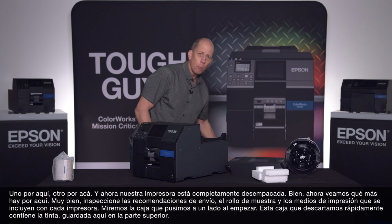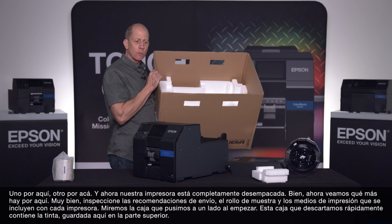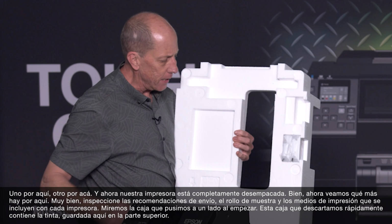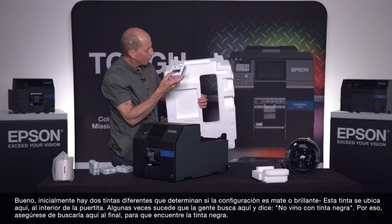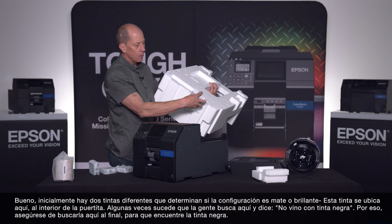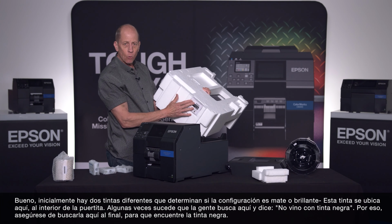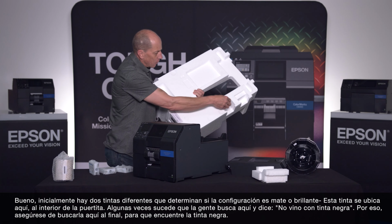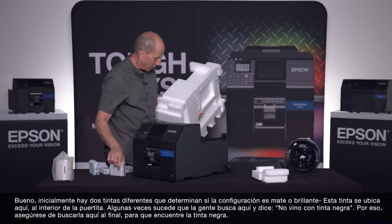And let me go back to the box that we took off in the beginning here. So maybe we took the box off quickly. What you're going to see is the ink is actually up in here in the top. Okay. So we've got two different inks. Originally, our ink that determines whether it's matte or gloss would have been right here where the doggy door is, just on the inside of that. Okay, so sometimes people grab the ink here and they go, I'm missing the black. Make sure you're looking at it right here at the end to get the black.